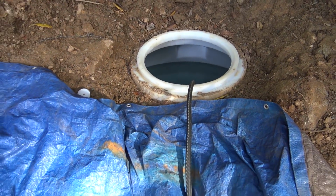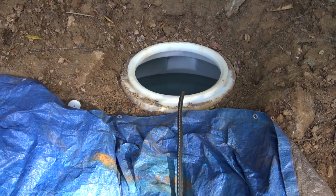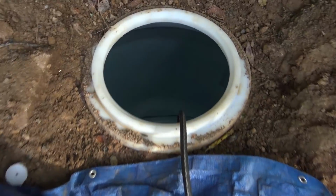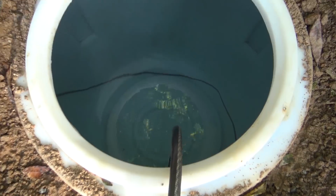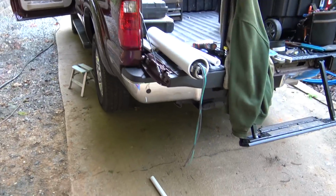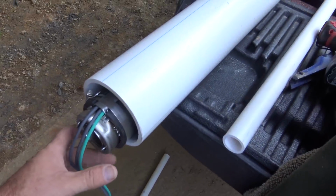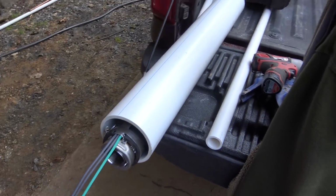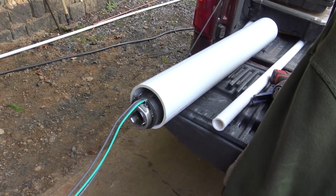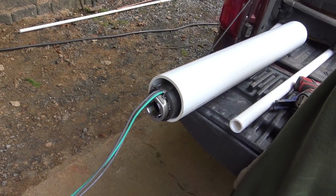Even though there's soft start, the pump's gonna vibrate a little bit, and I don't want that over the years wearing on the bottom of that center elevated section of that tank. So the 4-inch PVC will bridge that, and the pump will just sit in there on rubber bumpers. So we got rubber isolators, cold motors, and tank saving sleeve. Just a real simple, cheap solution to keep this thing going forever.